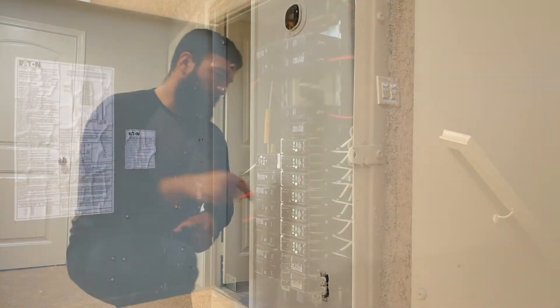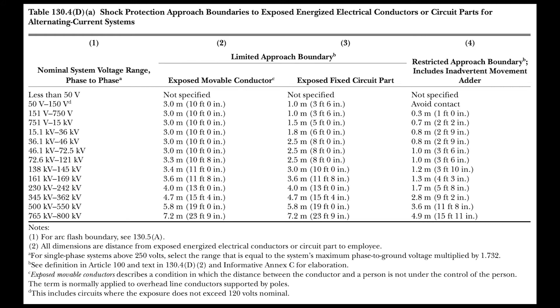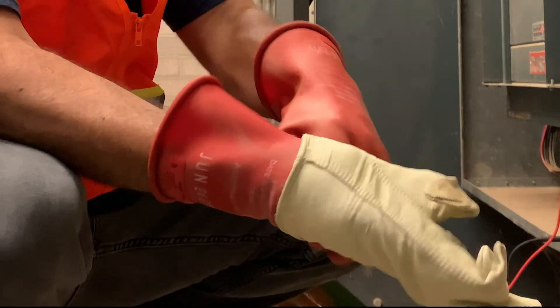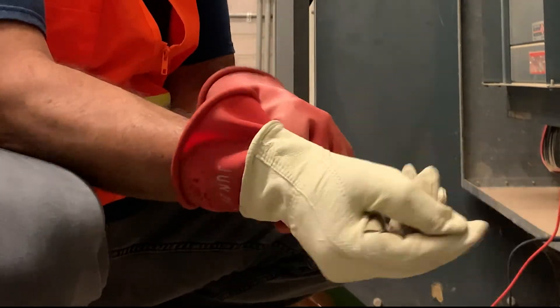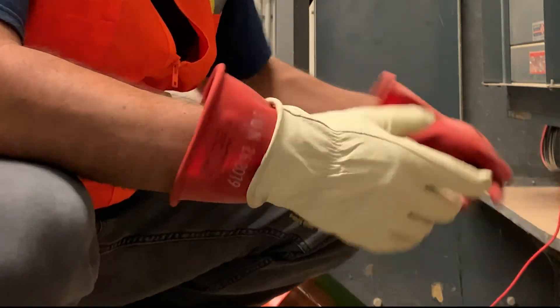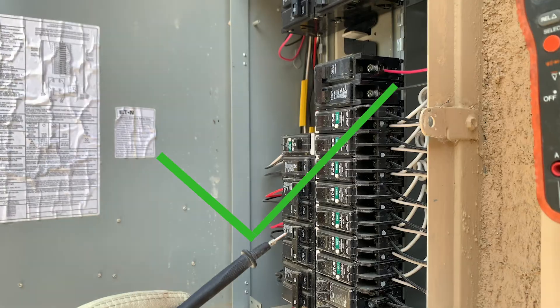Let's take a look at the table again. For 151 to 750 volts, go over to the restricted column — you'll see it says one foot. That means if any part of your body gets within one foot of an exposed live part, it needs electric shock protection, so you would have to wear a glove. In a residential panel, if you have the dead front off and you need to test in there, you've got to have your gloves on — and if you do, you're perfectly fine. This assumes you're permitted to be doing the work in the first place.